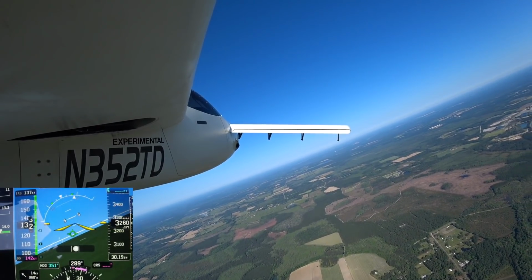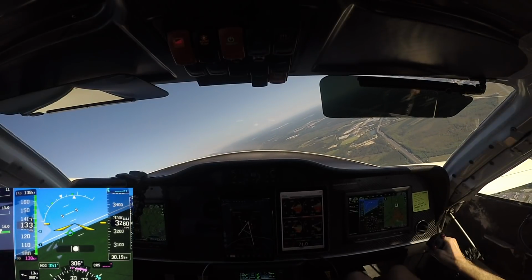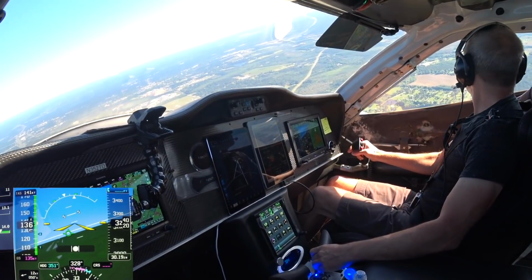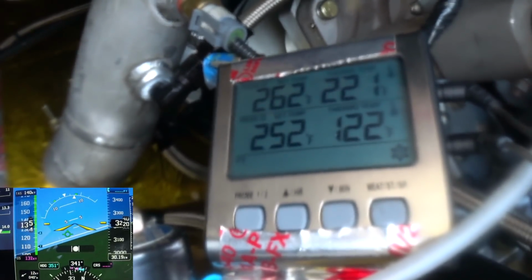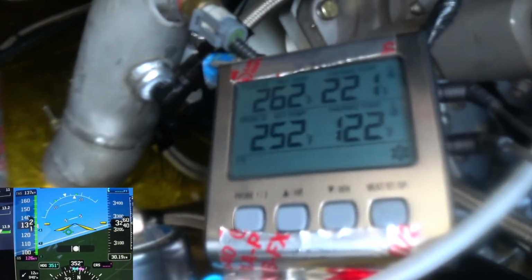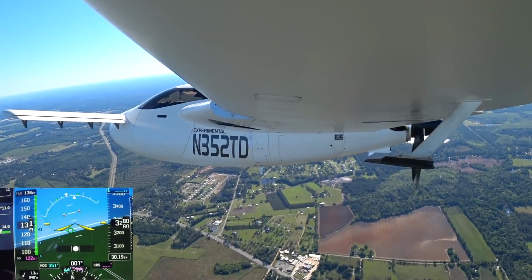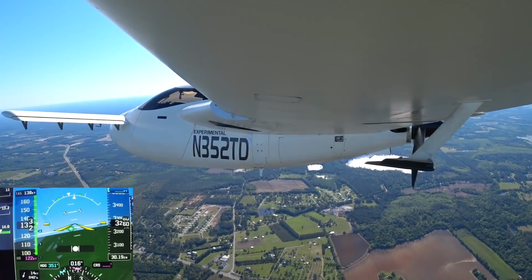And I was noticing I was occasionally getting the low oil light coming on just briefly, just for a second, and then going off again. So potentially a little bit more oil needed in there, but I'm kind of thinking more that this never used to do this with the other oil collar in there, the steel one. So there's obviously not quite as tight a tolerance on this one. And potentially what is happening, and what my thoughts are now, is that it's not as tight as the other one, so more oil's running through it, and that's what's bringing the low oil light on at the sump.